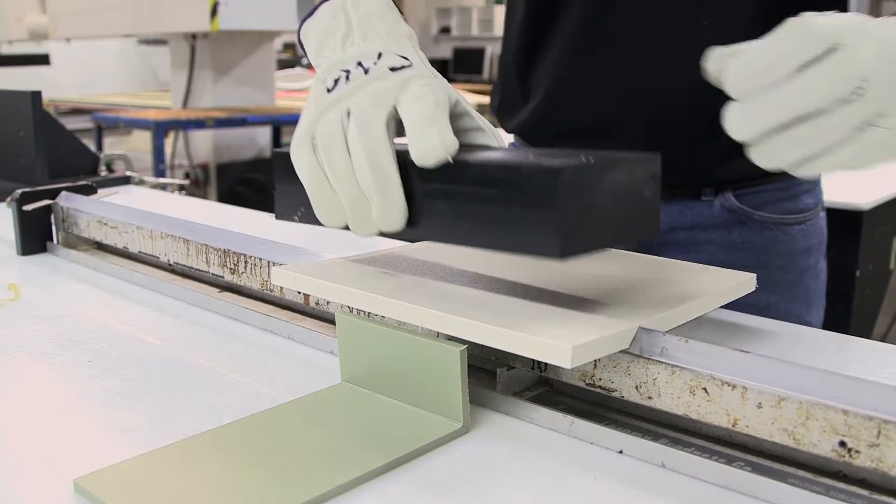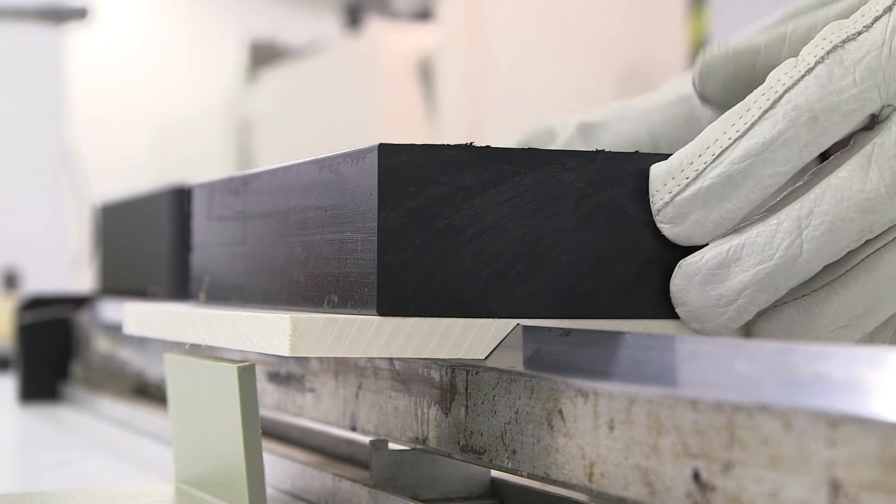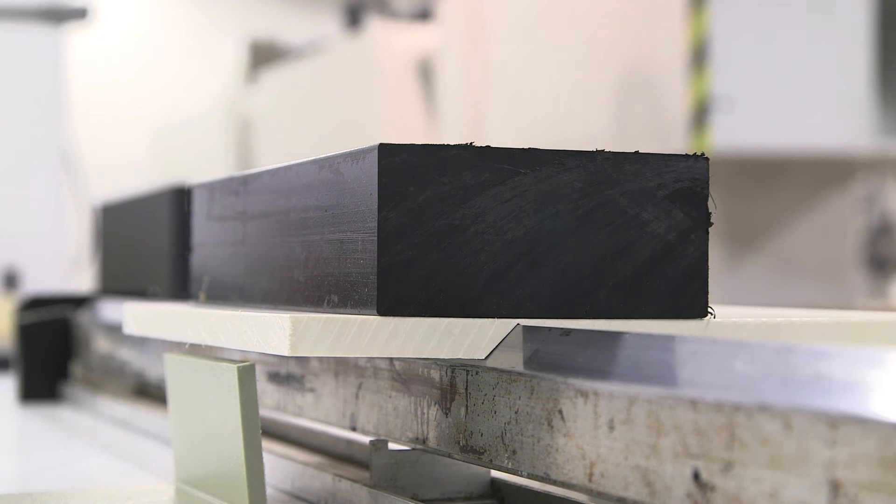For example, if you are bending a 24-inch part, a weight of 20 to 30 pounds must be applied to the part uniformly to hold the part down to the bending bar. The weight may need to be adjusted if the temperature of the bar is warmer or cooler, but the weight is needed to force the plastic edges to be in complete contact with the bar.